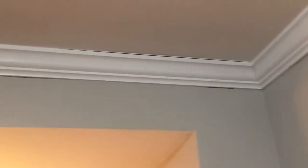Some of it's cosmetic, just from previous paint jobs. This area in here, I can see that the paint itself is actually curling up there, so that's going to have to be flaked away and patched. And then this area right here, you can see the trim is just separated from the ceiling. I don't think that dark area is separated — I think that's paint. So we're going to have to come in here and caulk these seams with some white painter's caulk.